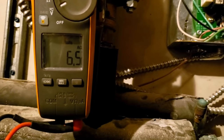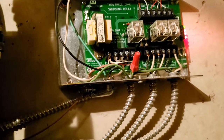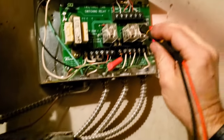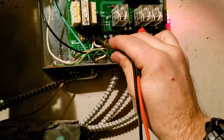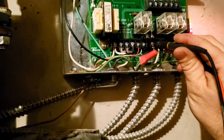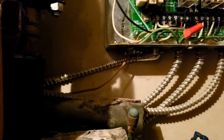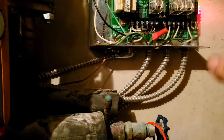These are power-stealing stats which I'm not a fan of. Checking across our fuses here — it's a little hard to do with the phone. No matter how I measure it, I'm not getting 120 volts to the circulator. I pull those relays, I lose the 120 volts, but the neutral — it's not connecting. If I go from neutral coming into the panel to the hot leg, I've got 124 volts. When I go from neutral to hot — nothing, nothing on the next one, nothing on the next one. The neutral's not connecting to these neutrals over here.